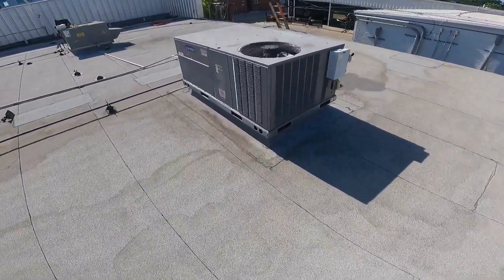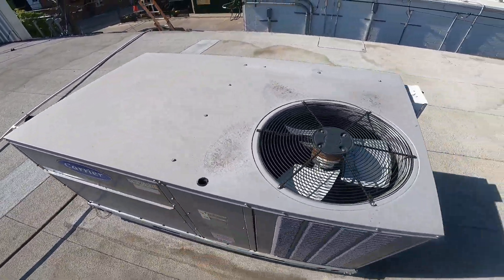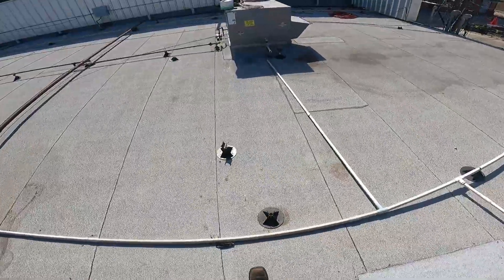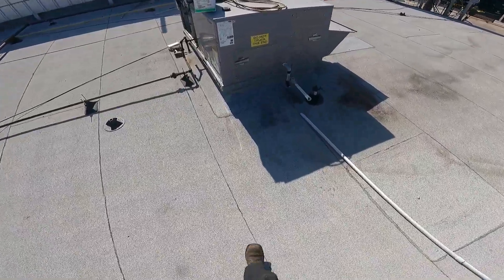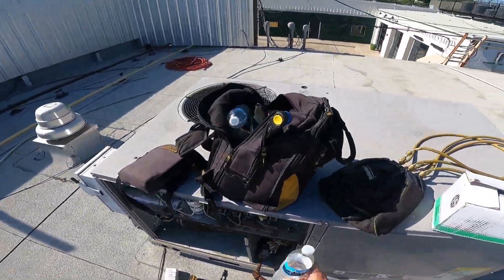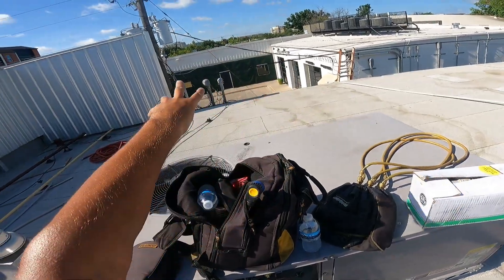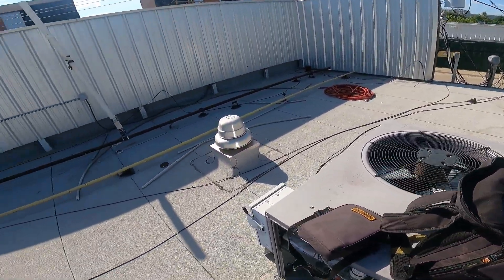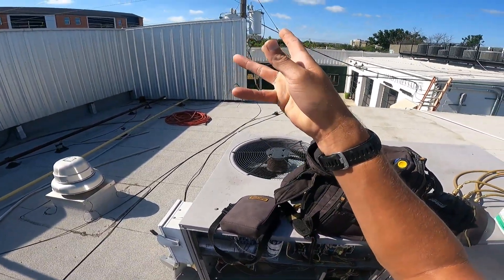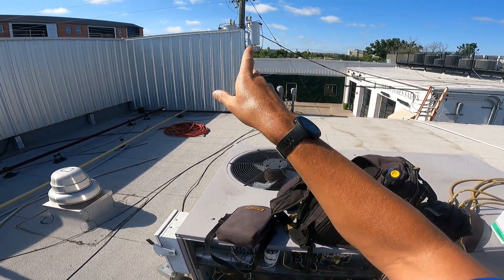There's a good trap right there, working perfectly fine - no vent tube, not my worry. Got another air leak over here - same thing, they stuck a hole in the supply and the return, which is fine, but plug it back up. I don't think this guy is one of my units - it hasn't even tried to turn on yet. This is probably all they got, and it's already condensating and dripping. It's probably humid as crap in there - this thing hasn't been running about a full day.